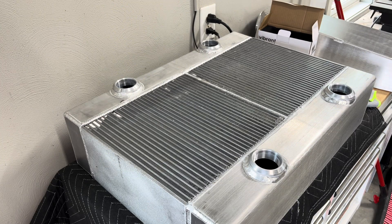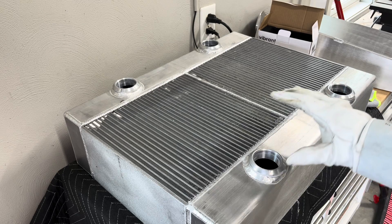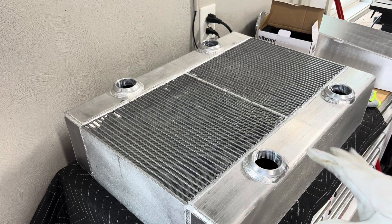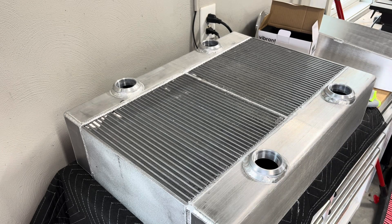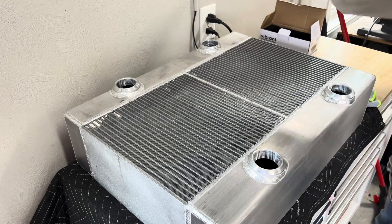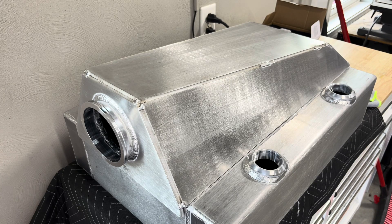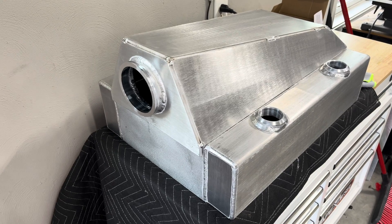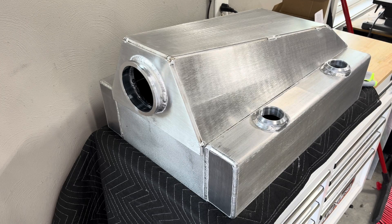So we went ahead and this thing's all wrapped up. I ended up pressure testing it — put 40 psi in it, sprayed all the welds down with soap, no leaks. So we know we're good on the water side. I've already started welding on these and making some videos, but that's the air tank side that goes on it. We're going to be making some more videos on welding all this up. Yeah, everybody like and subscribe — I hope you like the video.